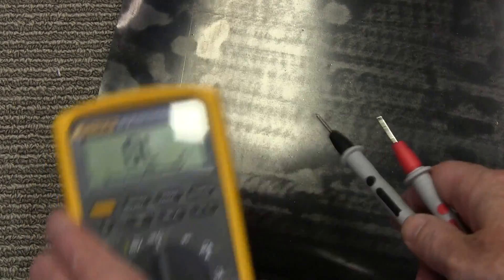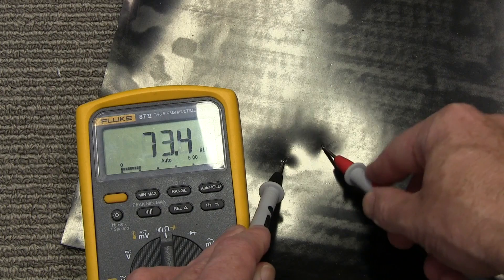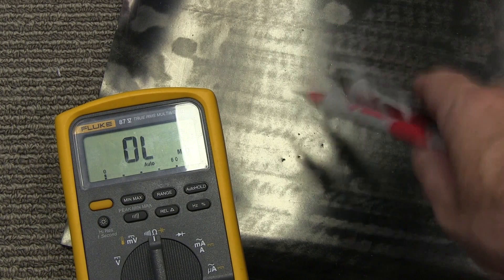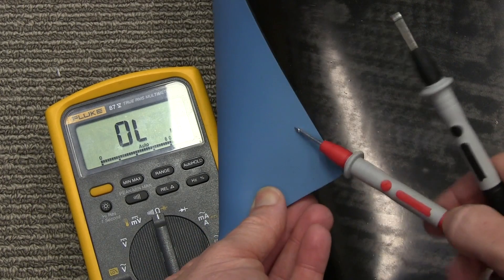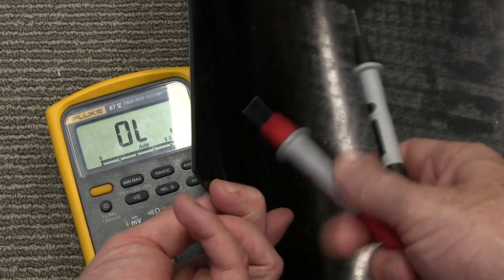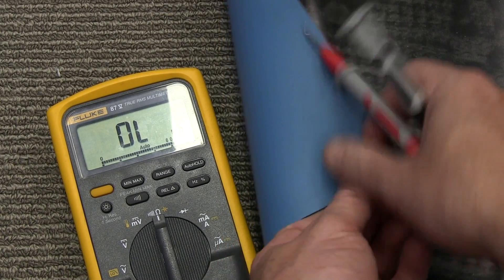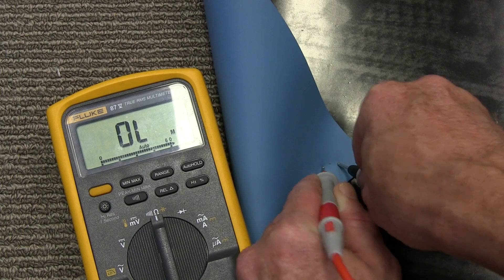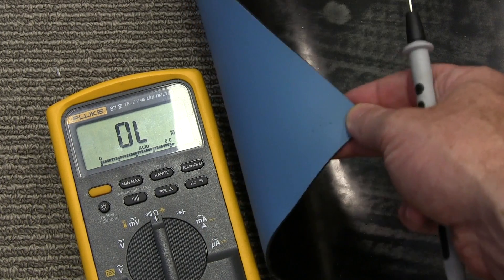They're really great stuff. Now they have two layers. The back is actually conductive — let's measure that. There you go: a hundred-odd kilohms or something like that per centimeter. It does have a value, but it is conductive, and that's the one you want to earth and drain away all the charge. The top surface is not conductive — it's what's called static dissipative, so it basically will not build up a static charge, and any charge that does build up drains through to the conductive back. And because it's next to impossible to penetrate — look, these are really sharp probes and I'm pushing really hard, and I cannot get through to the bottom layer. It didn't go through, so it's completely safe to power up live circuits on these mats.